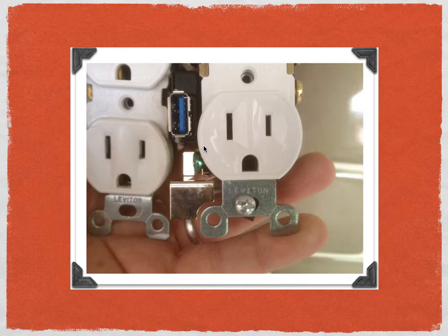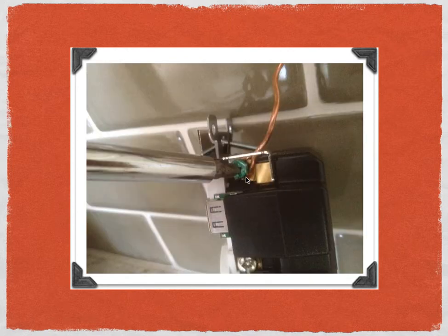Here's a picture of me installing the ground wire. What you want to do is go through that silver tab and wrap the ground wire in a clockwise direction around the green ground screw. When you go to tighten it, you want to tighten that ground wire around the screw. If you wrap it in the opposite direction, the wire is going to come loose when you tighten it. So it's very important to remember to wrap clockwise.